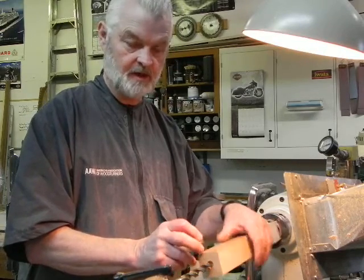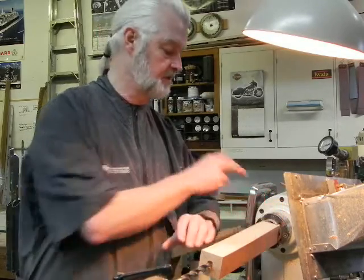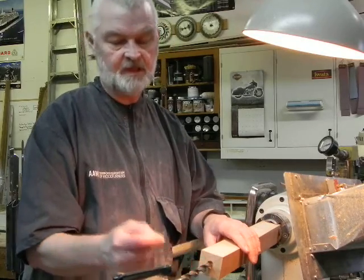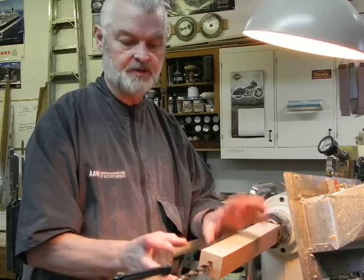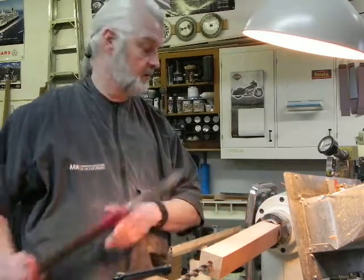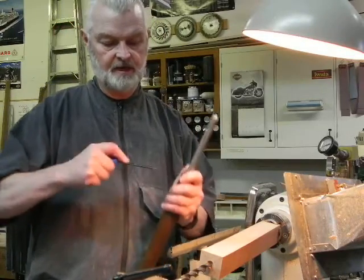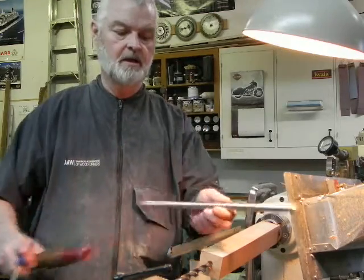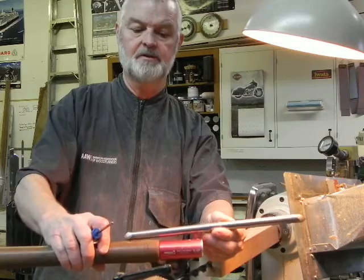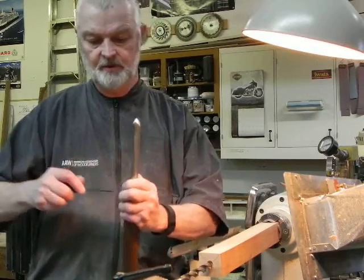Murray's going to be able to edit a lot out of here, but I'll first show you how I drill this using the lathe — you can use a drill press as well. I started this already, just very slow. This is not a brad point drill; it's just a regular twist drill and I've drilled it very deep, or I'm going to drill it very deep. You don't necessarily have to drill them this deep, but I have a couple of double-ended one-way tools so I need the depth to bury the other end of the tool.